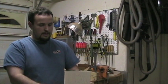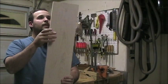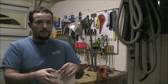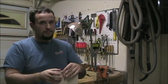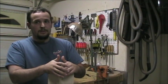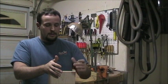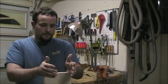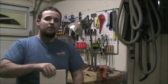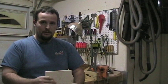This piece of maple is going over to the table saw to be cut into three pieces that are two inches wide, then we'll do the glue-up. I'm not going to use any off-color strips in between — just three pieces of the curly maple right next to each other for a nice continuous figure. But some folks will take a strip of walnut, cherry, or Indian rosewood and put it between the pieces. You could use purple heart, padauk — really whatever you want to make the neck look classy with stripes up the back.